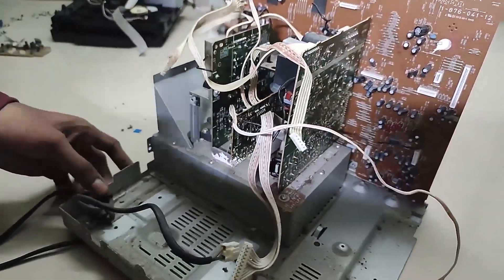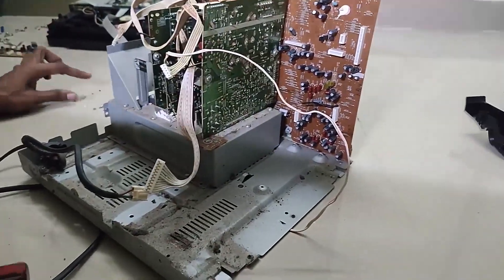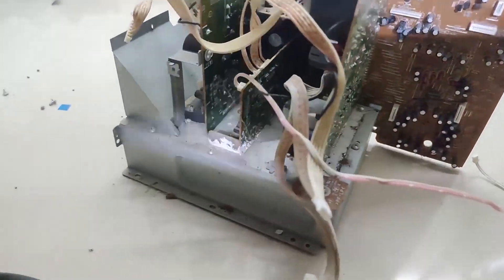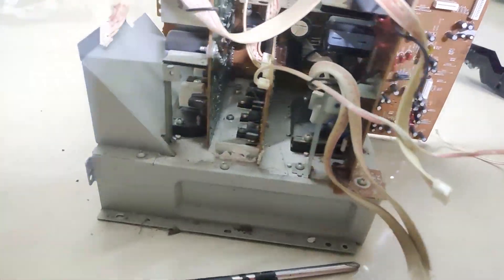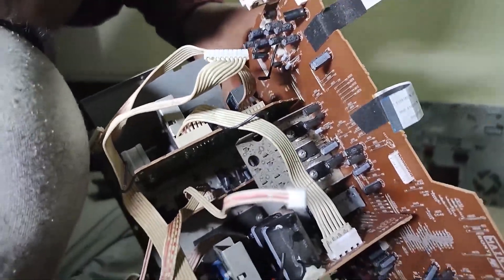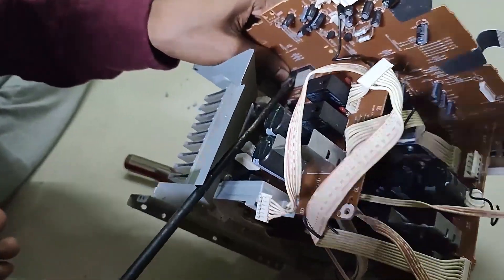On both of those boards there are a lot of relays for protection — this thing has over-current, overload, and short circuit protection. It's really well built but the components are cheap. The main thing they did with this model is that the amplifier section, audio processing, and preamp are all inside that small board beneath the tray mechanism — DM18 or DM8. That board has the preamp and the volume control — everything digitally embedded. If you blow that IC, that board won't power up, causing the entire system to go to waste without that RAM IC booting up.